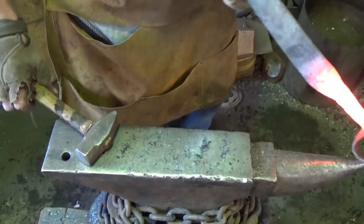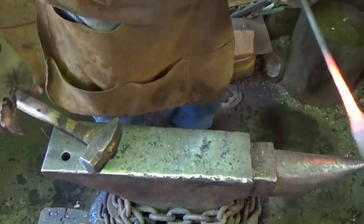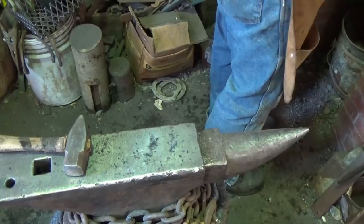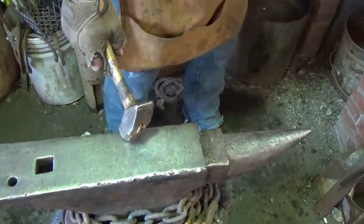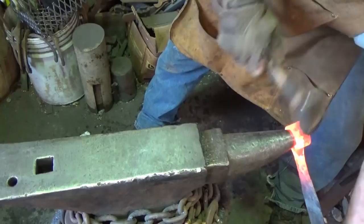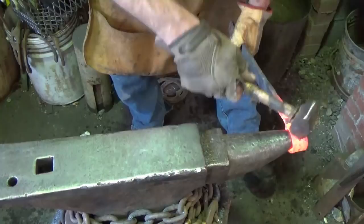Hopefully this person is a right-handed hitter. So I'm going to put a taper on this side, like you would a tomahawk kind of fit, so that we can put a tapered handle in and not worry about fitting it or anything. I'm just turning quick on a lathe. You'd call it a tomahawk taper, I don't know. Then we've still got to harden this again because we're stupid. I'm going to basically fuller out this side, thinning it a little bit but changing its diameter, so that there's a bit of a taper on it — and I think that should be just fine.